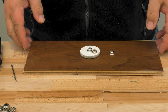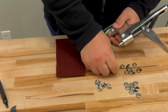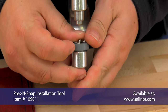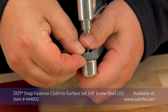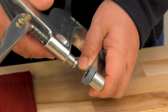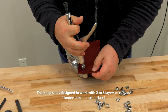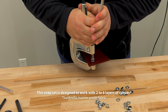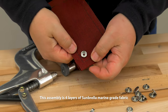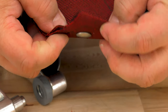Now let's move on to the installation of the button and socket. First we'll start with the press and snap tool. We'll take a stainless steel button and place it in the bottom die — this die has a rubber gasket that holds the button in place. Then the stainless steel socket snaps onto the upper portion of the die. Position the snap at the appropriate spot and depress the lever. It punches the hole and sets the snap with just one squeeze of the lever, and our button and socket are installed in the fabric assembly.